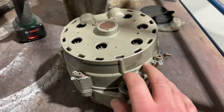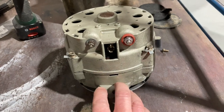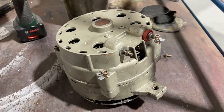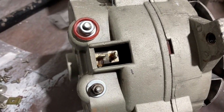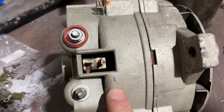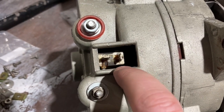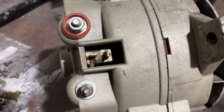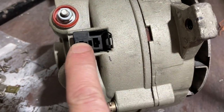We've got a few charging system issues again on a G1000 Cessna. Now on these G1000 Cessnas — in fact most of the latest Cessnas — the field terminals on the alternator are these Mickey Mouse push-on things and they give some trouble.